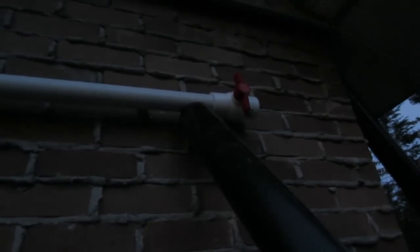The reason why we have a 1½ inch ball valve is because we want to be able to shut off the water going to the totes during winter, because she's going to drain it during winter since she's here in Idaho. That'll stop the water from going to the totes. Obviously we don't have this attached to the wall yet, but we'll attach it as I mentioned earlier.